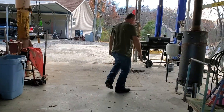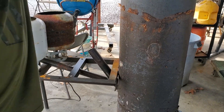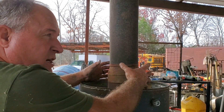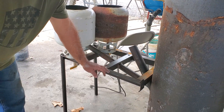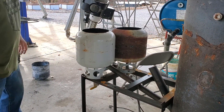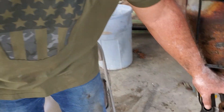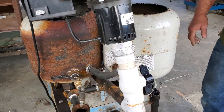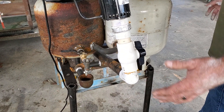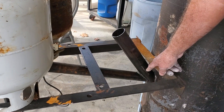This is another one that I made and on this one I put two tanks. Same process: two-inch pipe going down to the burn bowl, six-inch pipe coming out, and I usually put an eight-inch exhaust because I want a big exhaust. You pretty much have to make a platform to put these oil tanks on. I put a three-quarter outlet right here into this pipe — that's where I drip my oil through. Then I have a fan blowing in. This is inch-and-a-half pipe going into a two-inch, which works pretty good since it's forced air anyway.